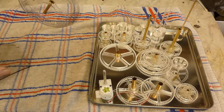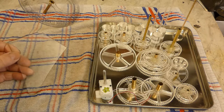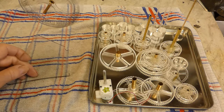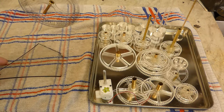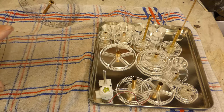Now the holes — in our test piece and prototype these were drilled on a drill press, but the holes in the final version are going to be cut with the CNC. The smallest hole is 2.6mm diameter for tapping with M3 taps. Being 2.6mm, I can use a 2.5mm cutter to cut them out. So we've got to cut nine of these to make the three layers, and that's the next job.